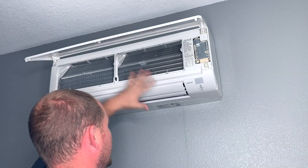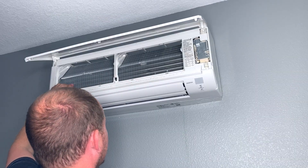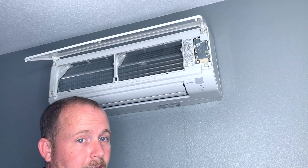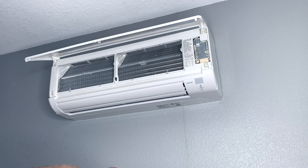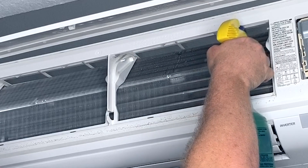All I'm going to do here is spray down the evaporator coil — I'm not going to take it fully apart because it was recently done — and then spray the bottom row into the drain pan, and that will take care of the odor. One thing about Evap Plus in the gallon jug: you don't dilute it, it just goes on straight. You don't have to worry about mixing — just put it in a spray bottle.